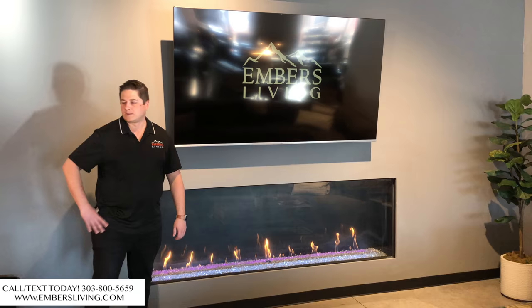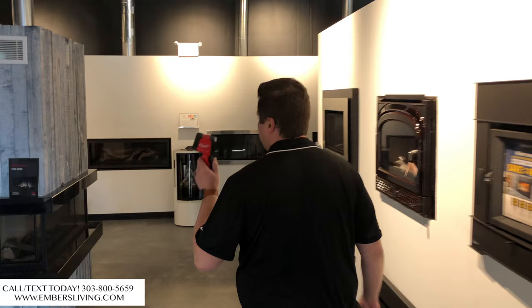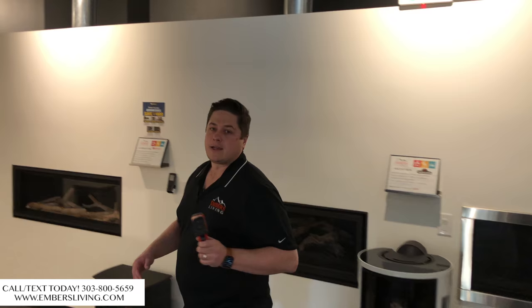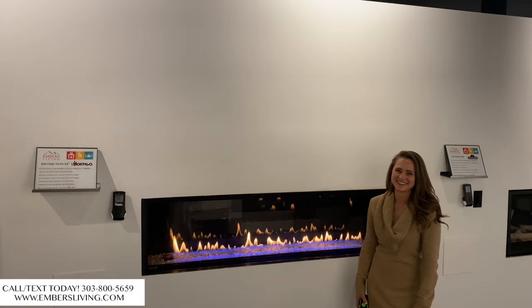Follow me — we're going to go over to our linear fireplace section and show you a couple different ways to achieve this. I have a laser heat gun so we can measure temperatures on some of these fireplace walls, because that's what we want to focus on: what is the temperature of the walls we're dealing with? If the wall is too hot, that's when you're going to have an issue installing your TV.